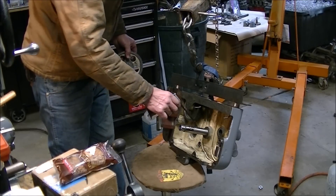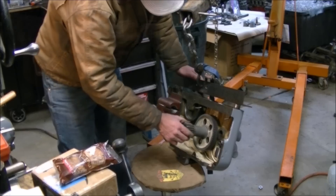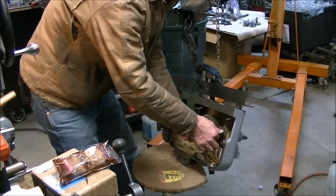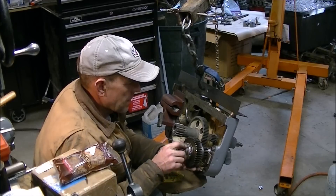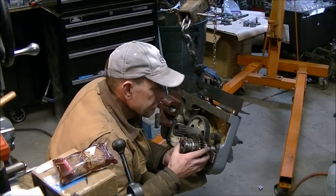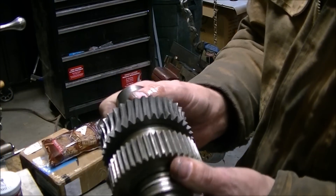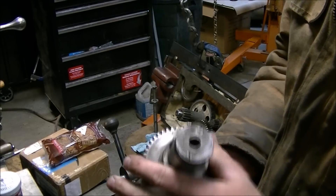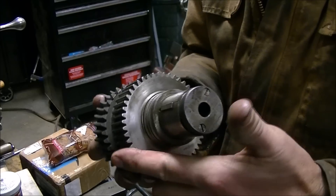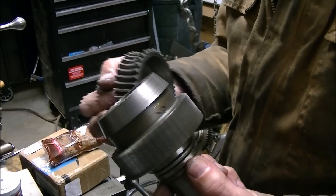Continuing with the reassembly — the big gear that runs the longitudinal feed along the axis of the lathe is actually driven by a little pinion gear that goes onto the handle. This is the clutch assembly for the power feed on the longitudinal feed. It's a little bit tricky; you kind of have to pull gears out and slide them in together. This is a close-up of the cone and the worm gear — that cone presses into the worm gear and drives the power feeds as the lever pushes in on it.